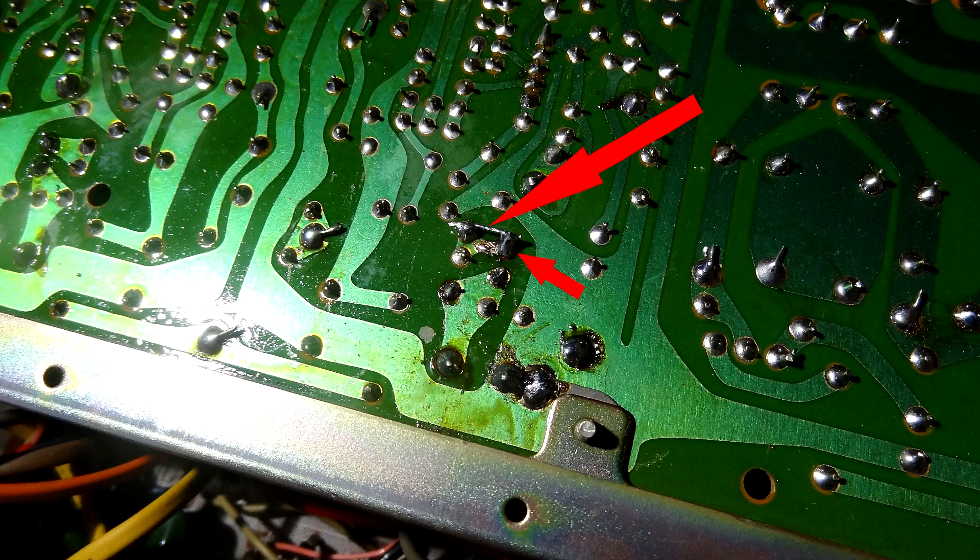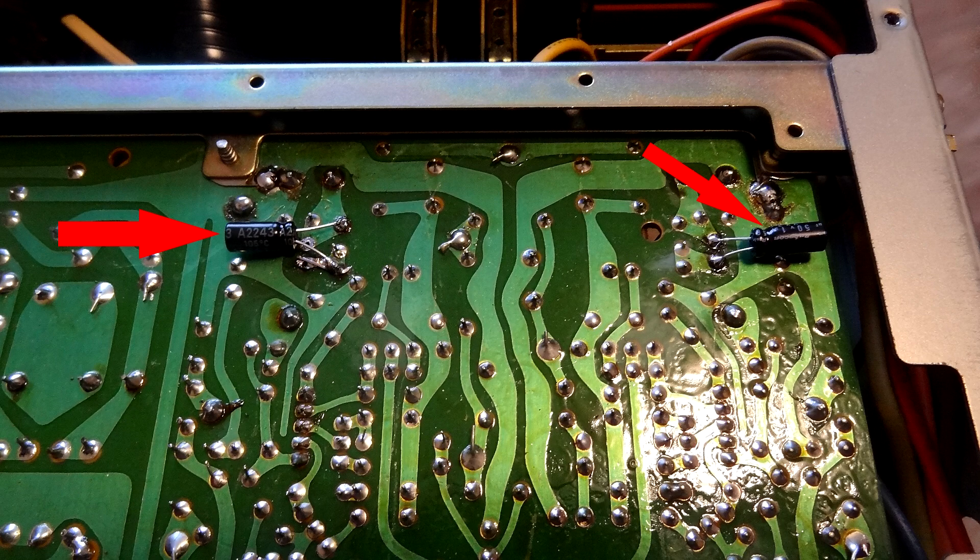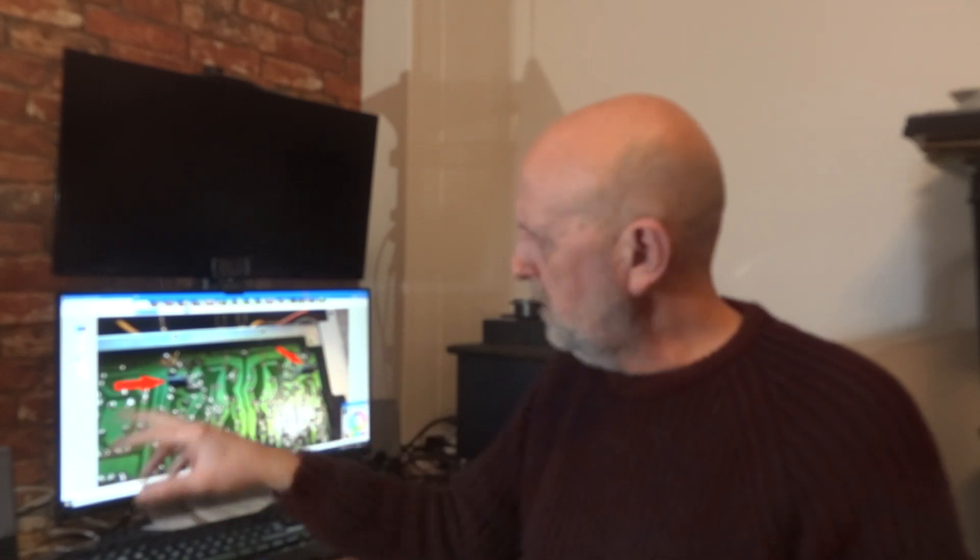Taking these in and out I used a 30 watt iron - maybe I should have used a 15 watt iron but I just couldn't be bothered to get it out. I used solder wick rather than a sucker. Unfortunately a track was lifting and you can see that big red arrow - I put a little piece of wire just to bridge it across. After that I decided to do the swapping on the other side of the board rather than poking them through the holes, which is easier.